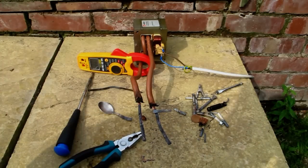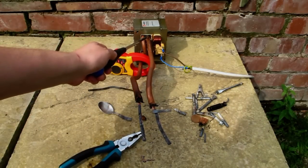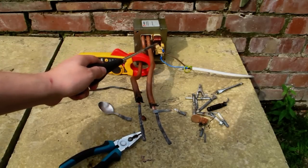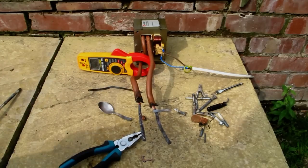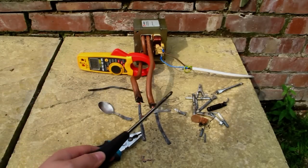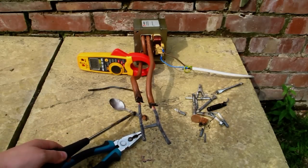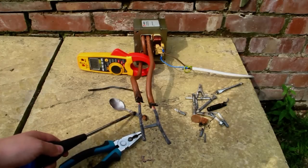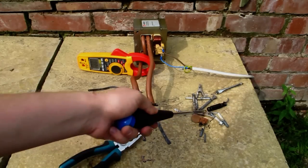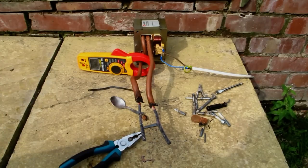That was a bit of fun, but I think we've got work to do. The magnetic shunts between the secondary and the primary are still there. What I'll do is try and get them out and get another turn of this cable. Then maybe with the extra turn on, I'll have a bit more voltage to overcome the resistance as the material heats up - because I think that's what's stopping me. At 1.8 volts, there's just not enough to get the current flowing through stainless steel and all sorts of other material. Still some work to do, but good fun anyway. Bye!